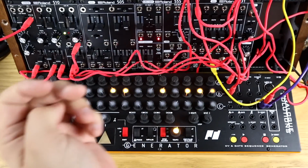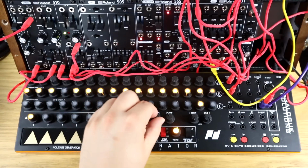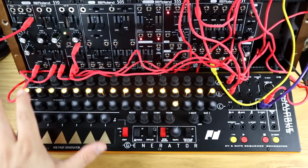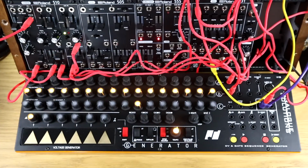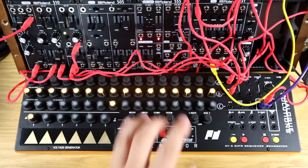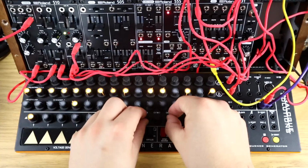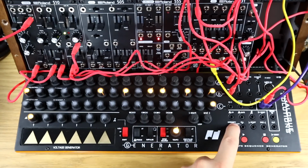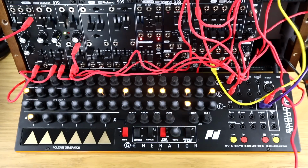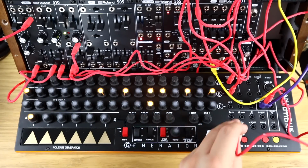The top row here is pitch, and then using these gate densities, I'm sending an envelope to my filter. So as I jam around on these, we'll hear that filter envelope cut in and out with different gate rhythms. And we can influence this with the intensity input and actually take an LFO, and you'll see the LEDs change, you'll hear the different envelope patterns.